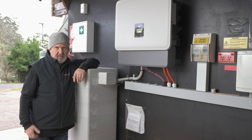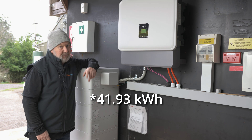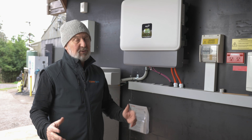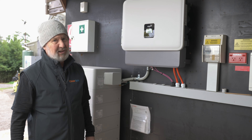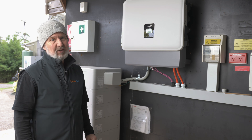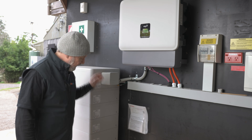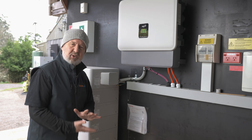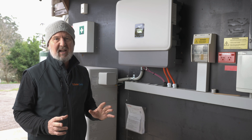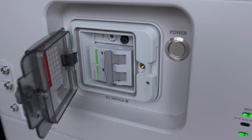At 1.3 meters tall, that is 41 kilowatt hours of storage in this tiny footprint. That's great if you happen to be interested in the cheaper home batteries program, because you want to get as close to 50 kilowatt hours as you can if you really want to max out that rebate. But for 41 kilowatt hours, that's a lot of storage. These inverters can do VPP of course, so that battery can make you money, especially when you combine it with an agent who provides the VPP functionality. The way these work is each battery module clips on to the next one — there are no cables, so it's super quick to install. The top unit contains the BMS and also on the other side a double-pole DC breaker, so it's got built-in isolation and overcurrent protection on the battery itself.